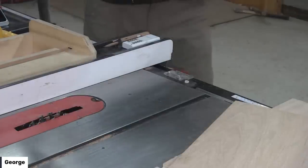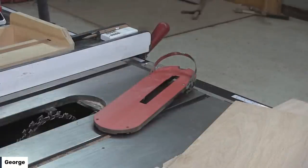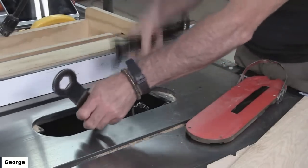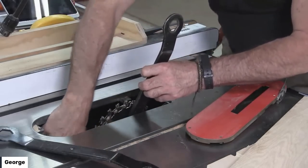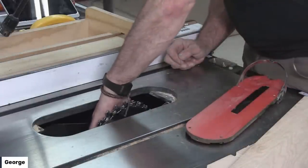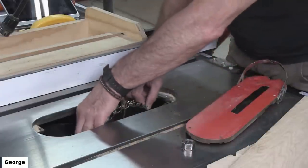So I'm unplugging again. I know the height of the dado is right, so I don't want to mess with that. And I'm going to guesstimate we're only a couple thousandths off of that not slipping in. So again, this is why I said at the beginning, that gauge board is great, but you still need to do test cuts, and this is why. For whatever reason, we have just a little bit of variation there. Like I said, it's within a couple thousandths of going in. So do a test cut in scrap and confirm before you do your entire project.